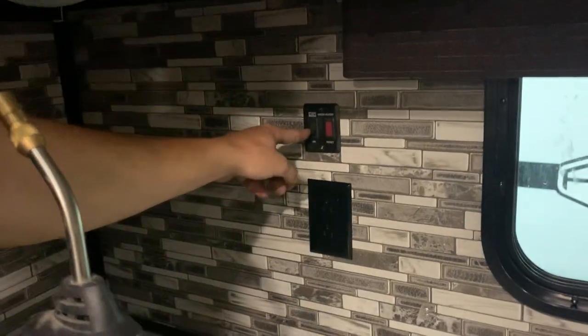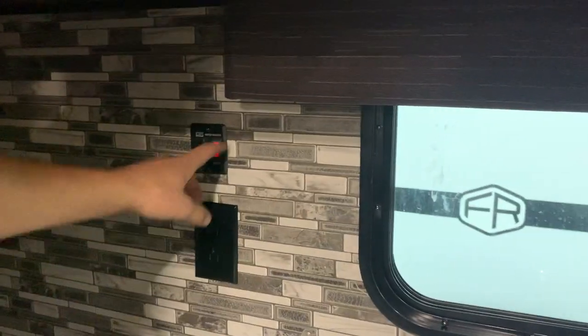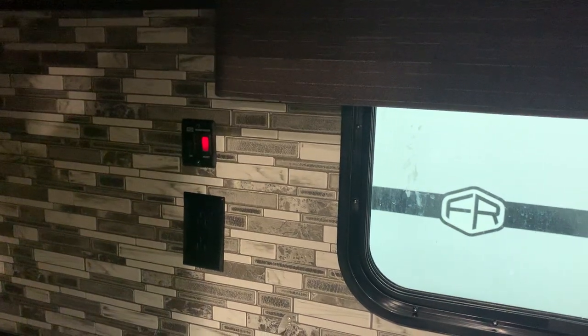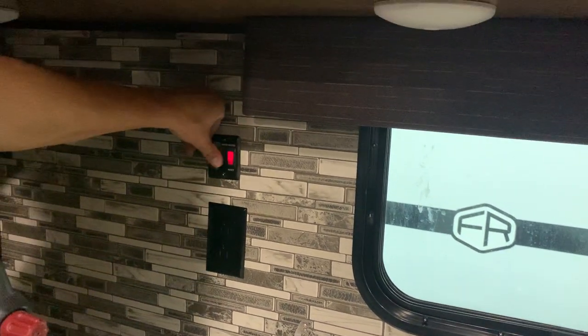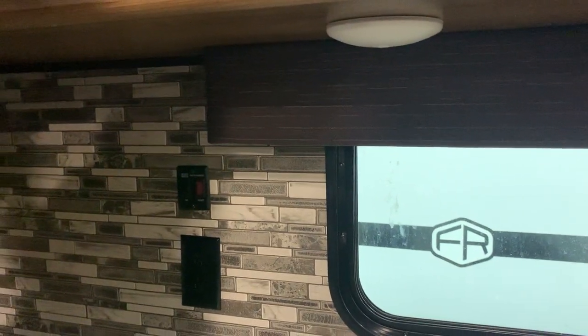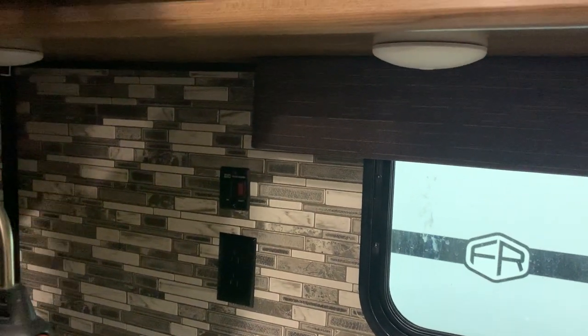You've got your microwave, which is just like home. On the wall here you're going to have your switch for your water heater. Turning that on, this little red light is going to come on and the water heater is going to try lighting itself three times. If on the third try it doesn't light, this light is going to stay on — in that case you do just have to turn that switch off, go hit that reset button outside, and then come back in and try relighting it, because sometimes it does take a bit to get all the air out of the lines.